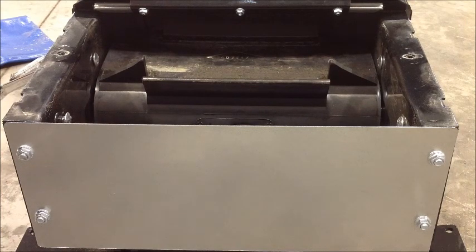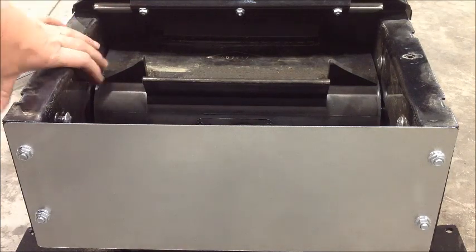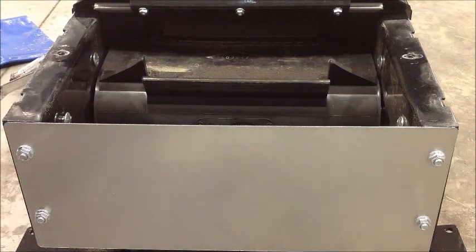Tightening or pushing the bearing down pushes it away from this side. So if the belt were tight to this side, with the conveyor off of course, we'd make some minor adjustments, then run it for 10 or 15 seconds. Once we get close, we'll let it run a little more to make minor adjustments. Safety is the best thing — keep your hands out of it, tools out of it, and people away from it.